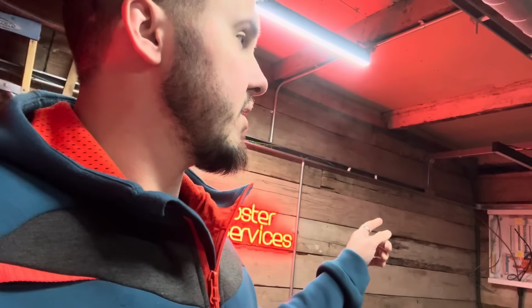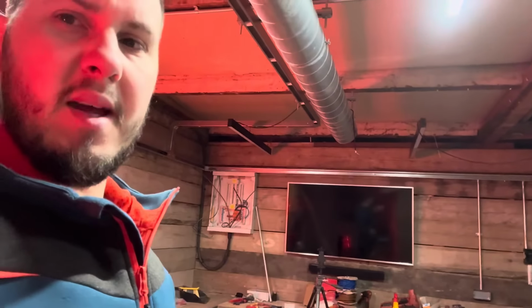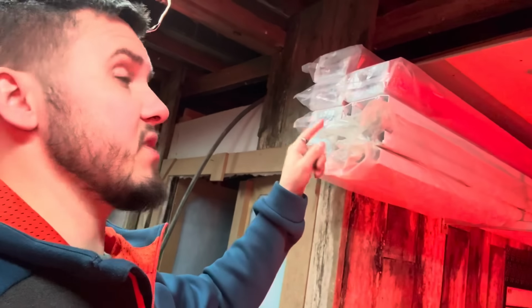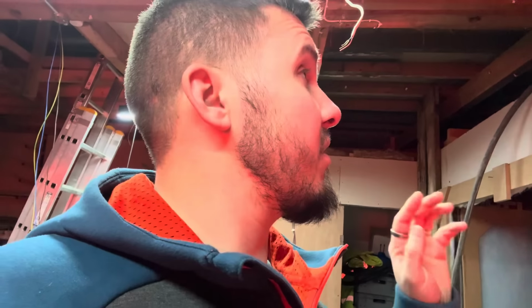So I'm going to get that board made off at some point. I need to wire this lot, but that's easy anyway. It's literally local right there. I've got to pull a couple of cables across the ceiling in that trunking to get into this area, but they'll be in twin earth, because as soon as it penetrates through the ceiling, through this cladding here, it's just going to be running in free space. So I'll wire those two or three circuits in twin earth just so they are okay.